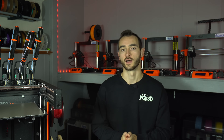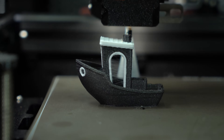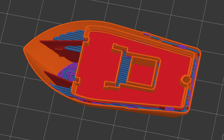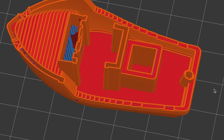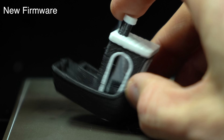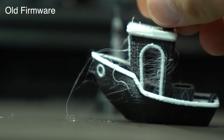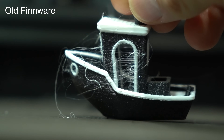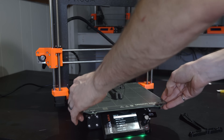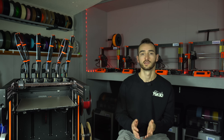As far as the performance, we're provided with two files for evaluation: a 12-minute bonkers benchy, and a 36-minute dual tool bonkers benchy. Worth noting is that these are sliced with very minimalistic settings — a single perimeter and lightning infill — which makes the speeds seem faster than they really are. But it's not just the speeds that are improved; there's also a considerable improvement to the stringing. In the blog post accompanying this firmware release, Prusa acknowledged the stringing issue that myself and many others have reported. They're reportedly developing a new technique called z-hop ramping, which will reduce the prevalence of stringing not only on the XL but on their other printers as well. But this has not been implemented yet. Despite that, the stringing is already less with the new firmware.